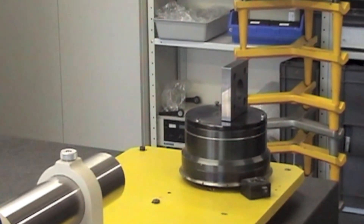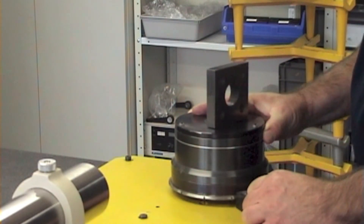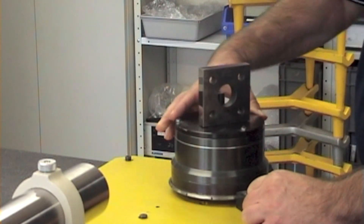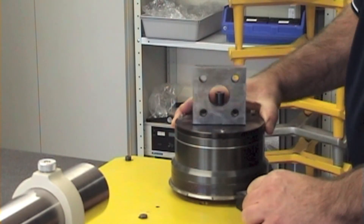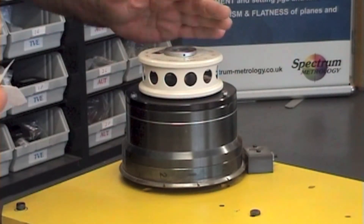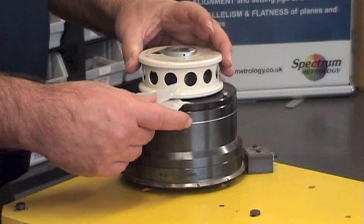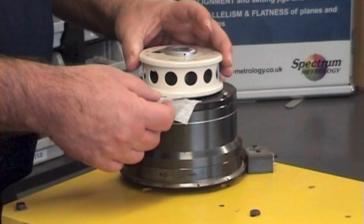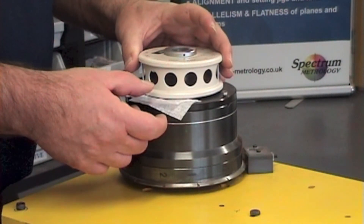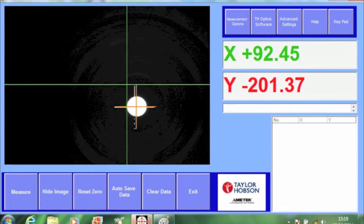This can be done using a square block. Rotate the square through 180 degrees, observe the y-axis readings and readjust to zero by tilting the autocollimator through half of the error, and tilting the table or polygon through the other half. Either use a simple leveling table for the polygon or use some shims, for example cigarette paper. The y-axis or pyramidal error should be less than 10 seconds.